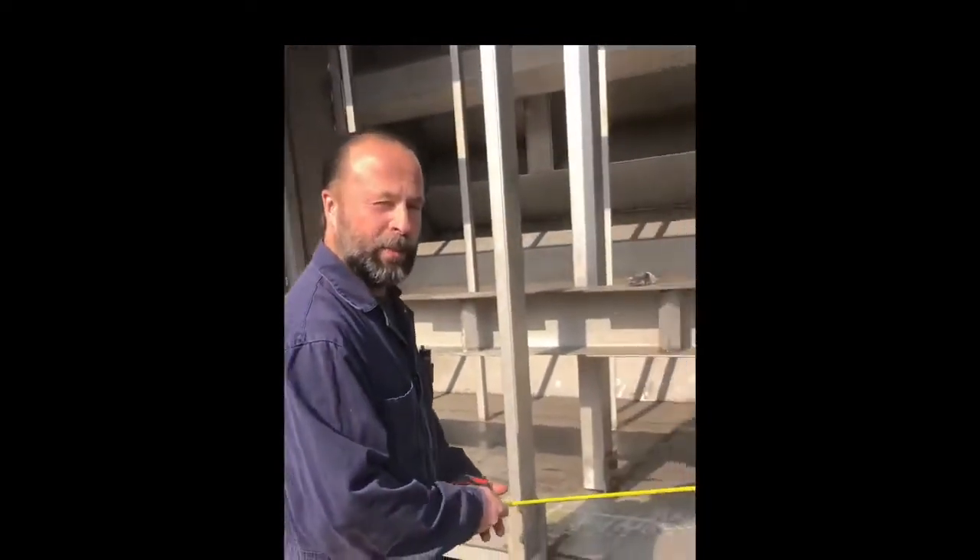Ray, explain all the areas of concern if we don't treat this. We want to cover the entire surface because in a lot of areas, where any metal has contacted it or scratches have occurred, you can see how there's iron embedded in the scratch and it starts to corrode. Especially when it's been in contact with water. A good wet spray is a good way of testing the surface to see if there's any iron contamination.